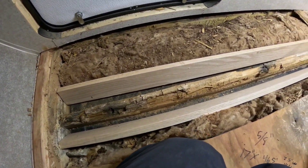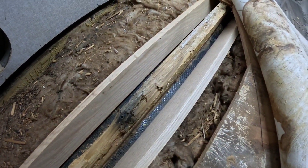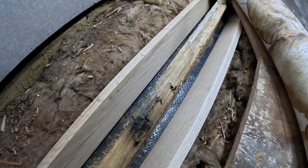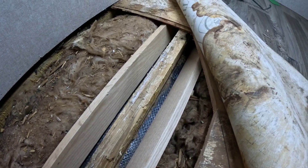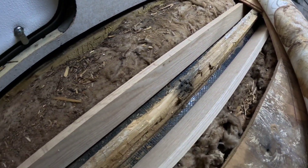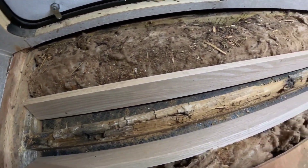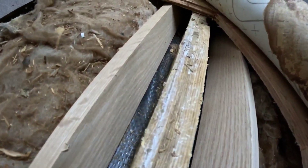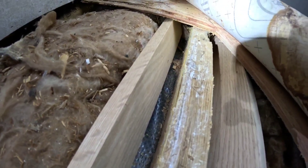Digging through the garage I found these one-bys of solid oak that I can actually use. They're actually pre-cut to two and a half inches wide from the store and they're four feet long — left over from another project I didn't need. So if you're looking to buy pre-cut, two and a half inch by four foot long is just fine underneath here. It's tucked under the edge nice and deep so I can screw it from the top without any problems.